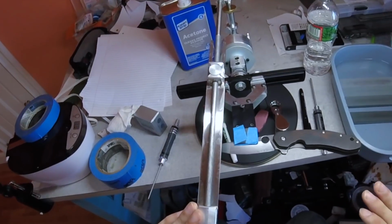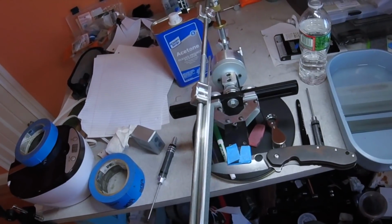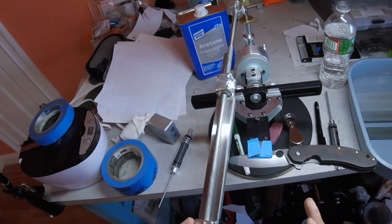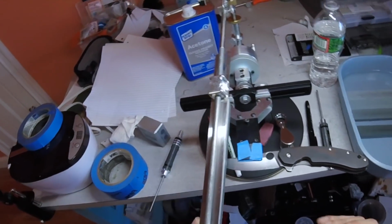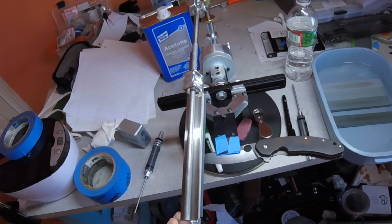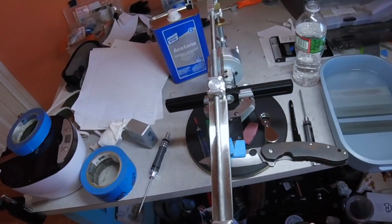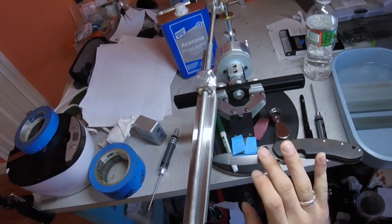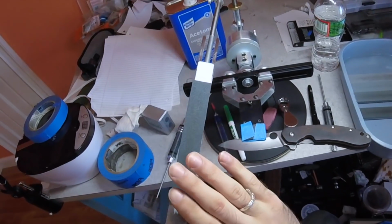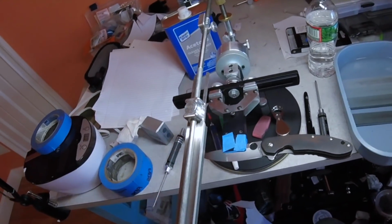Now, for general guidelines for your apex health, I would never get a burr with anything coarser than about a 150 grit diamond plate, like the KME Gold Series 140. That's your limit. Don't apex with the 100, don't apex with the 50, and definitely don't keep going and use pressure. Once you're at about 150 grit, if you apex with minimal pressure and then we de-stress the edge, you should be okay. With water stones, I would say about the same: about your 100 grit, you want to stay around there.